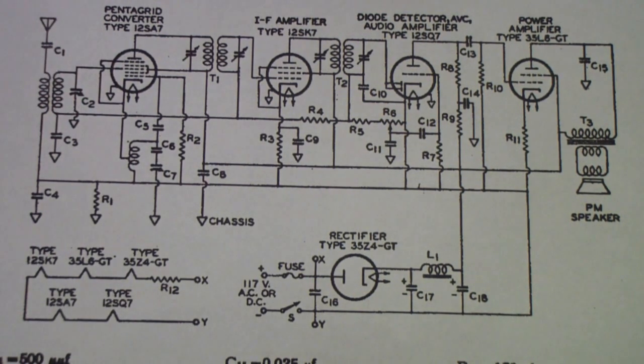Now, for those of you who watched the Frugal Repairman series, you know that I worked on actually 2 different radios. I started on one and then switched to an RCA because the first one I had just had too many bad components. It had an open output transformer and a trashed speaker, and it wasn't worth restoring. Most of these All-American 5s have to be in reasonably good condition to be worth restoring because they sold them by the tens of millions.